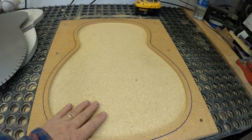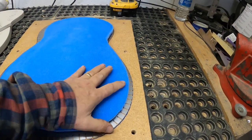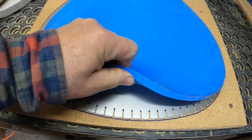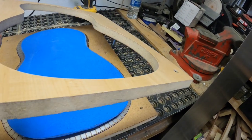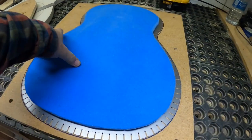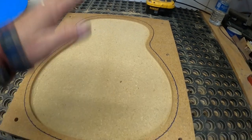The way this jig goes together: we start with the bottom piece which has the bolt holes. We put the metal piece on there, then foam goes on top of that. The foam is there to protect the metal from getting any sharp creases. The top piece goes back on and gets bolted down. We'll slide this whole thing in the press and hit it right there. I'm going to cut a square off the sheet and then put the sandwich back together before I press.